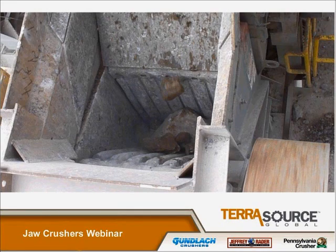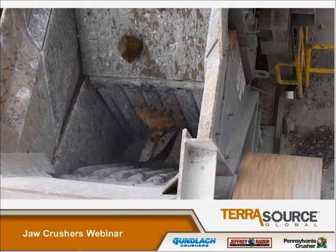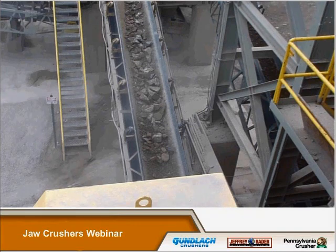This picture is a screenshot from a video of an overhead eccentric unit operating in a limestone quarry in upstate New York. Looking directly down into the machine, you can see a large piece of limestone between the two jaw plates. A second or two later, you can see the limestone beginning to break. As the material gets further down, more crushing occurs until the material is brought down to the desired size. This particular unit was set to about an eight-inch output, and the product is then taken away at the discharge belt.